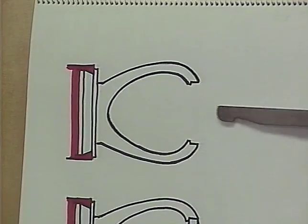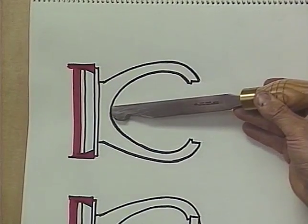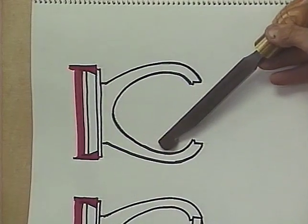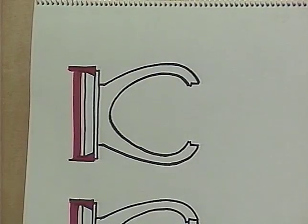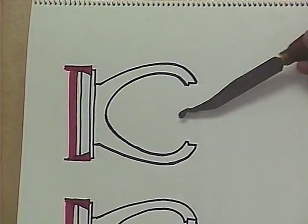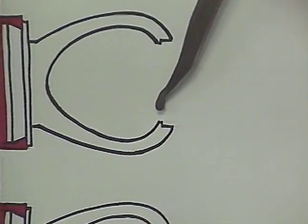Now we're ready to move in with the side cutting round nose scraper. Go down to the bottom of the box, then pivot slightly outward, taking that round. I need now to get underneath that shoulder, and you can see I've got this modified little swan neck scraper here that allows me to get back under there.